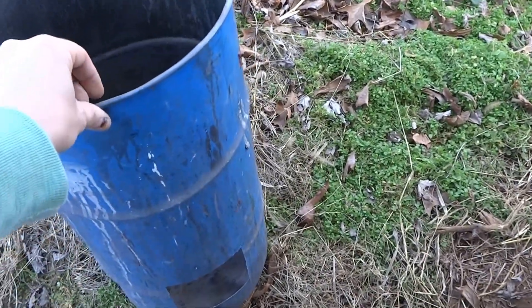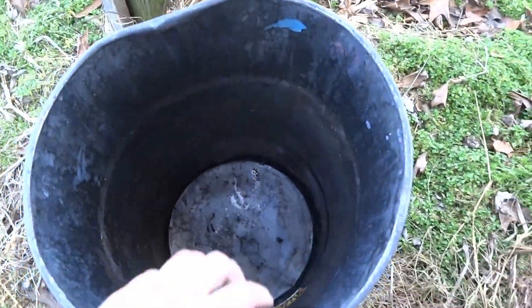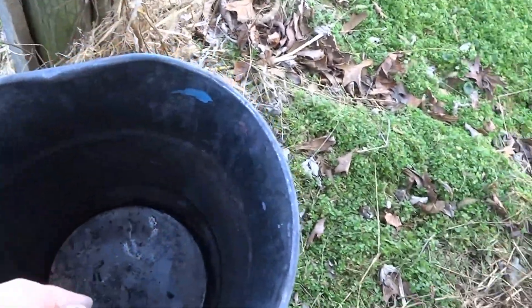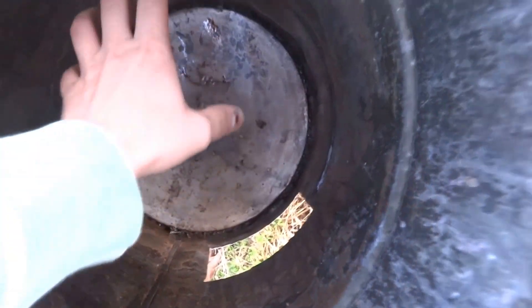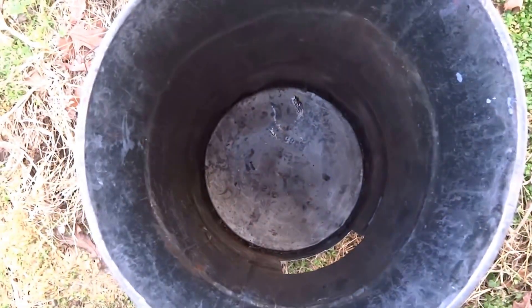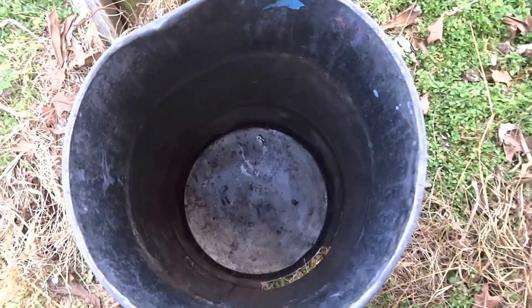My next project coming up is building a rocket stove. I picked this up at work for a couple bucks and already cut the hole in the side for it. I'm still planning on using the same refractory mix that I used in the kiln and just do the base on the bottom. I'm going to do a square porting down here and only fill it up to the top hole. Then I'll probably put a block of wood across here to fill it in, cover this up when I fill in the top, and then run a 6-inch piece of PVC down there and fill in around it. Once it's done, it'll be ready.